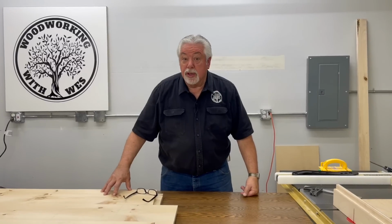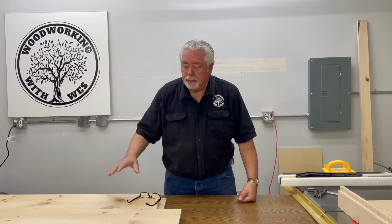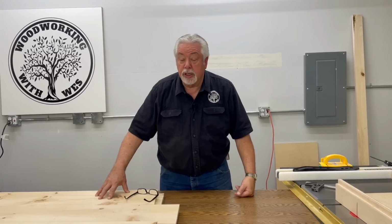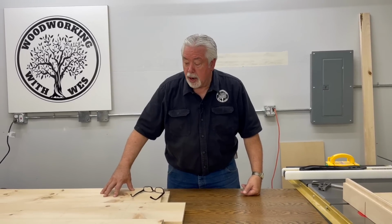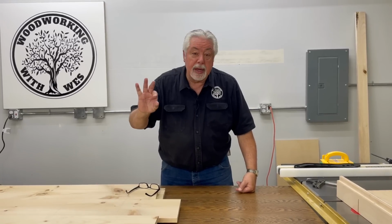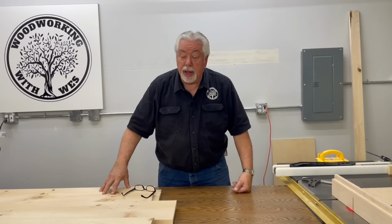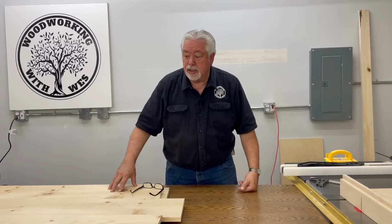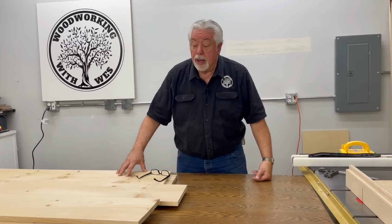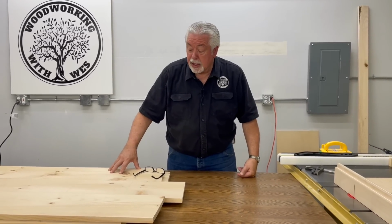We're now getting ready to do that portion of our sawhorse, the top portion, the barrel portion. I just wanted to explain a little bit about the wood that we're going to be using. The solid wood that we're going to be using is just pine. I purchased this from my hardwood supplier. It came rough sawn 1x12s. We've planed it down to 13/16. We've jointed one edge and cut the other edge to parallel it up. So we have S4S 13/16, and it's about 10 inches wide. We're going to be cutting it into sizes, so that isn't really that important. But just so that you know that we're going to be working with 13/16 thick pine to get started.